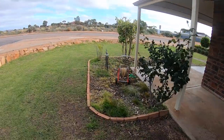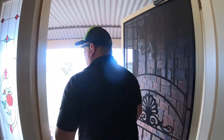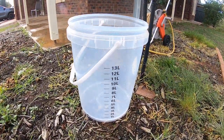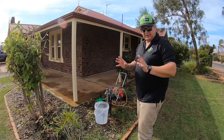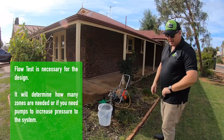This is my water source, which I'll have to do a water flow test on. A good way is to tell your irrigation place how long it takes to fill a 9 or 10 litre bucket. I've got a bucket here with increments up to 13 litres. I'm going to run the water for a minute. Now the water pressure here is incredibly low — it's really terrible. The irrigation designer will tell me if it's enough pressure for what I need, or if I need pressure valves or anything like that.